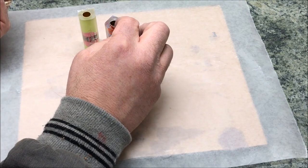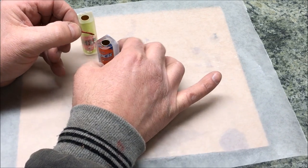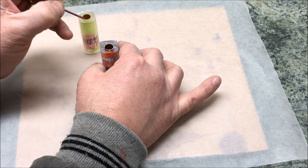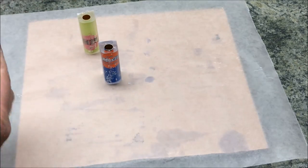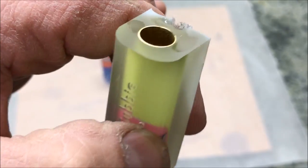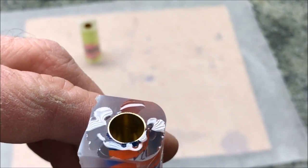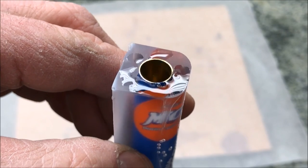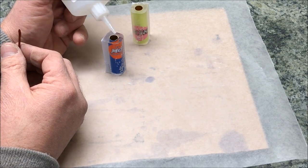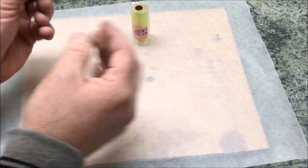I'm going to leave these, let them dry, and when they're completely dry we'll resurface them on the sander to get rid of any high spots from the CA. Once I resurface them we're going to turn them. They look good — no air bubbles, I've popped all of them. You can see it's nice and level and through the side the CA is clear, it should fill and hide those holes. The ones on the front are far enough out to turn away. The CA is working its way down into the blank and will seal all those little bubbles it can get into.